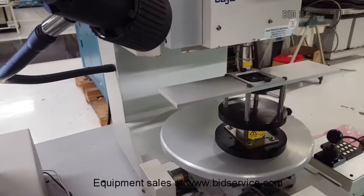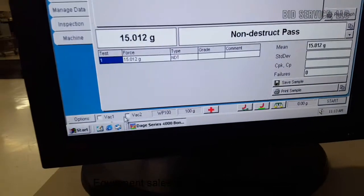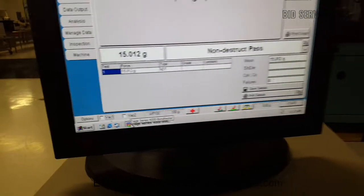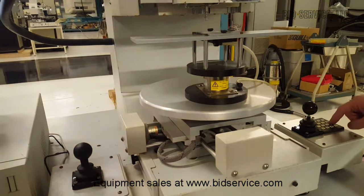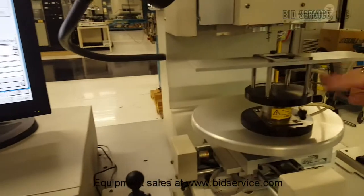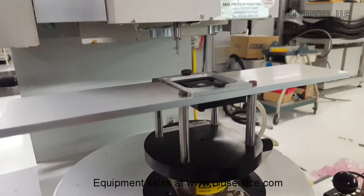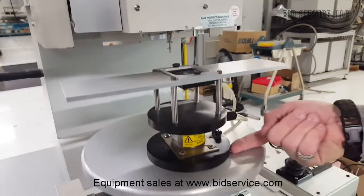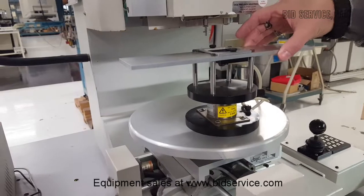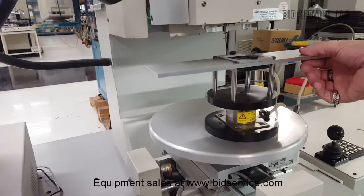There's also a feature for vacuum. Down here you have vacuum one and vacuum two choices — you can click on them with the mouse, or for number one you can press V, which also turns on vacuum one. Currently, vacuum one is set physically to the upper part here, and with the vacuum going I can feel some suction. If you enable vacuum two, that goes to the bottom here and makes the device stickier on the XY table. Our vacuum is not very strong at this point, so hopefully yours is stronger.